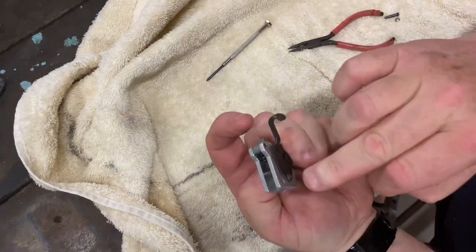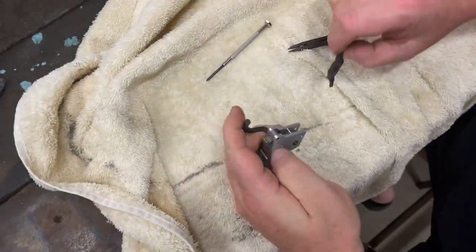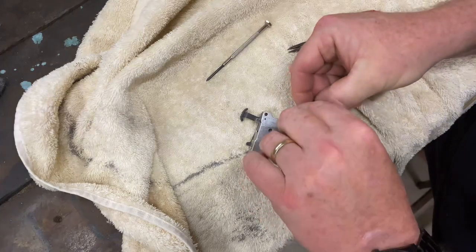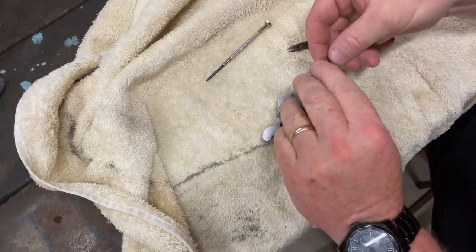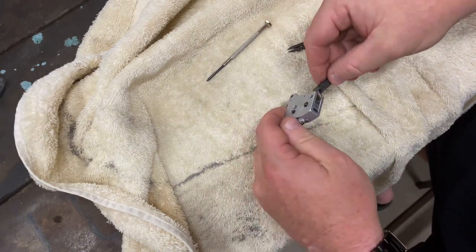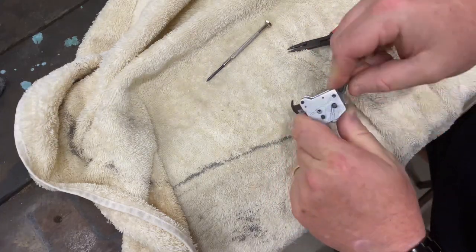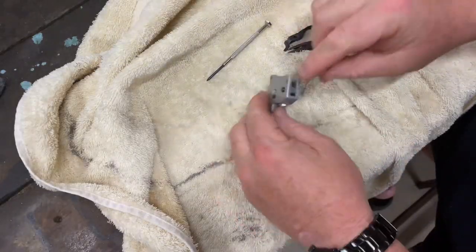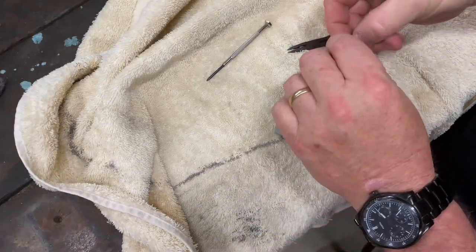And we've got, again, our holes just line up straight through there with our pin from the safety mechanism side. So here we go. This should be fun. This is a hard bit because you've got to work everything upside down. Otherwise, you can't put grease in these things and anything to hold the springs in. What I do is I whack him up there, put a little bit of load on the spring so you can get him up under there. I dropped him. And I get him in there and I'll just muck around with him and just manipulate him with that little pointer prong thing there.